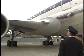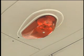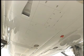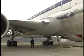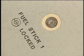Look at the inboard leading edge slat — it should be clean and undamaged. The landing light and runway turnoff light should be clean and unbroken. Examine the anti-collision strobe light for damage. Check the ram air inlet, the air conditioning pack access door, and the ram air exhaust — they should be clear and undamaged. Look for damage to the wing to body fairing and the underwing surface. Check for leaks from the fuel tank access panels and sump drains. The fuel measuring sticks should be locked and flush.